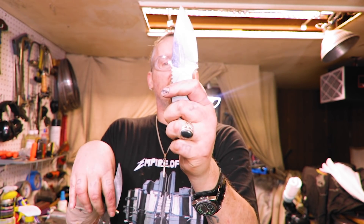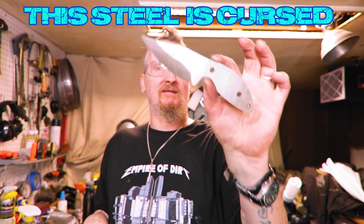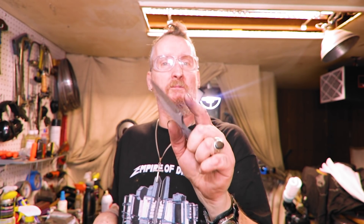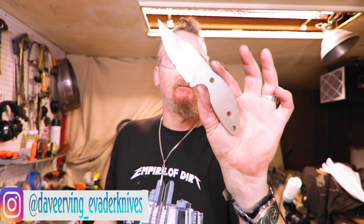While I was heat treating, I decided to try some 80CRV2. I've never tried it before, so I took an old design and made it a little bit better — first time with 80CRV2. This is 52-100. Unfortunately, if you watched the last heat treating video where I did CPM-3V, I got it to like a 62 or 63. But when I was tempering — you have to do three temper cycles, two hours apiece — on the third temper cycle I was grinding and didn't realize my PID was set to 1950 from when I heat treated. I came out after grinding and it was up to 1300. I ruined the temper. But since I got the oven cooking up, I might as well put this in.